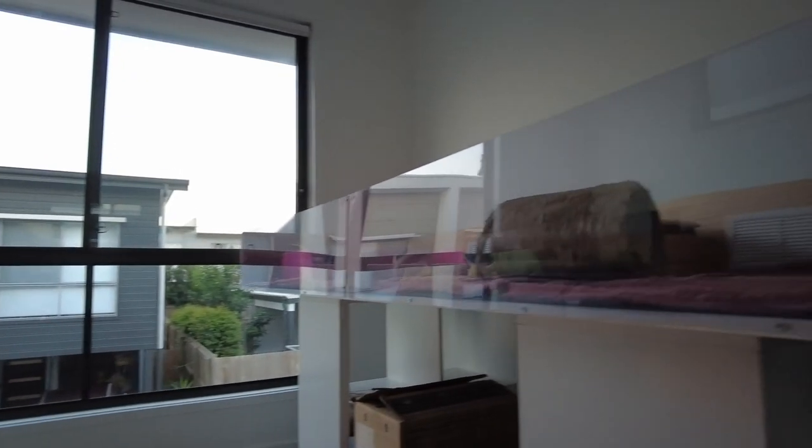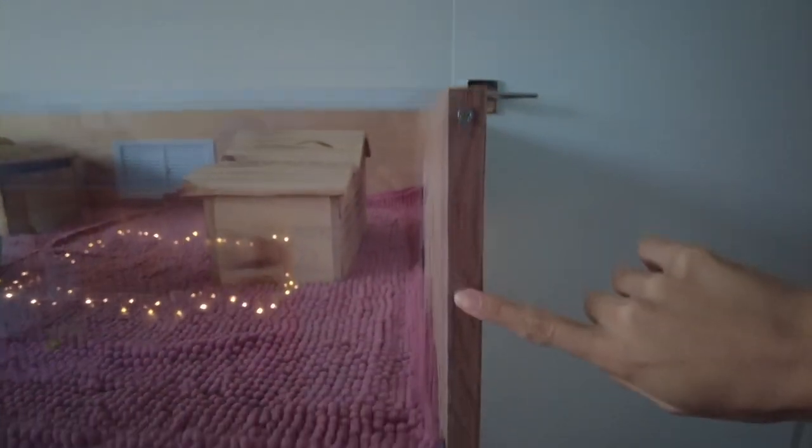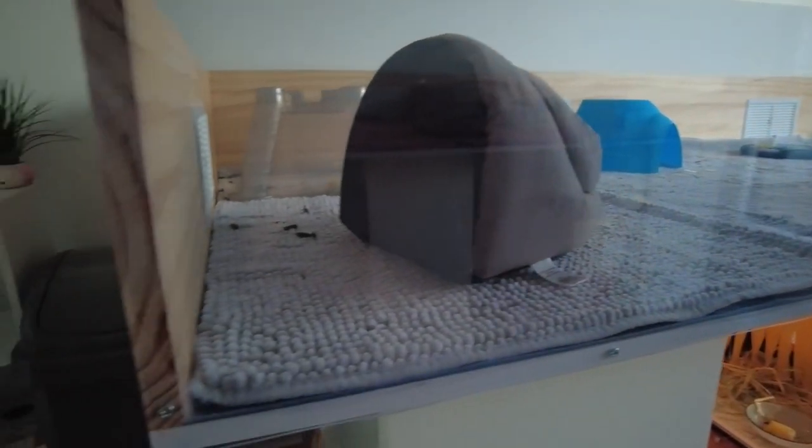You're going to keep the whole length of the acrylic for this build if you're doing a similar size, and you're just going to cut two pieces that are 25 centimeters high. The reason it's a little bit higher than the actual timber is just to make room for the base underneath. You'll see how it connects nicely and overlaps so you can connect the acrylic into the melamine base.